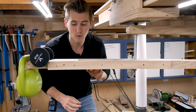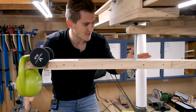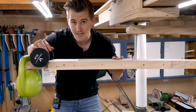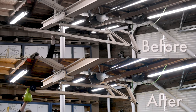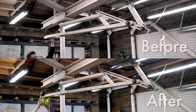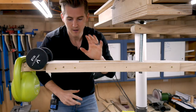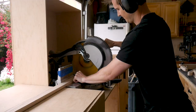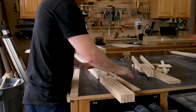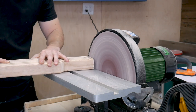Fast forwarding a few days — what I did was take some of the scrap plywood I had from the build and worked up this extension to the mount that attaches to the all-thread. I added 20 pounds of weight to the end of it just to help balance things out and it seems to work really well. It slides perfectly with the arm extended all the way out perpendicular — no bending of the beam anymore, it feels really secure. This is obviously really ugly, it's just a quick prototype. So I'm going to take the remainder of the scrap wood, something that looks a lot nicer and can hold weighted plates securely so that when this thing is swinging around they don't fly off.